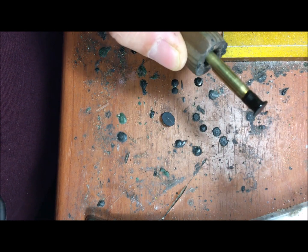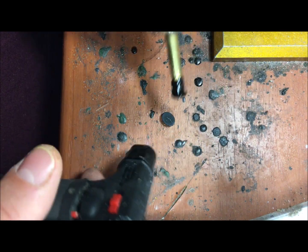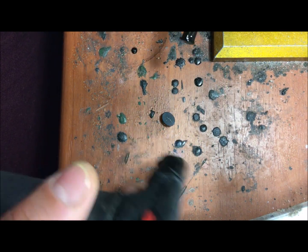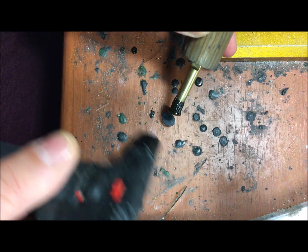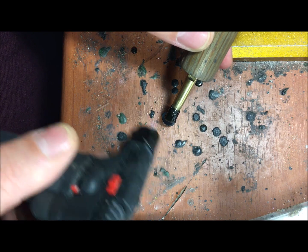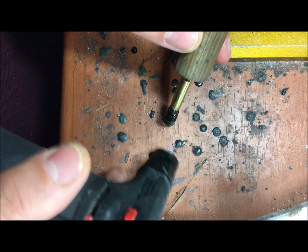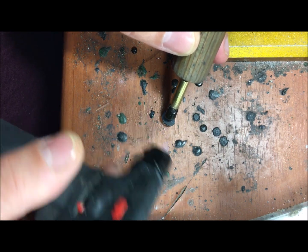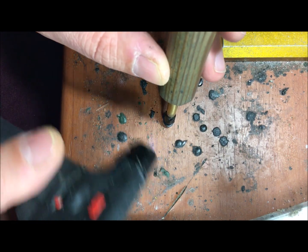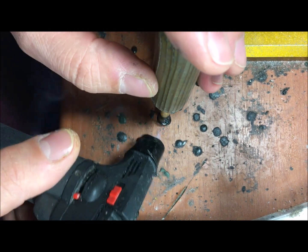Okay, I prepared the dop with the wax. Now we heat up the stone a little bit, and the wax at the same time. The sapphire is quite strong as concerns the heating. If you have other kinds of stones, you might want to heat them slower, and maybe on a little oven.